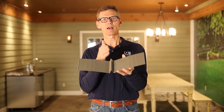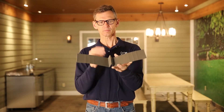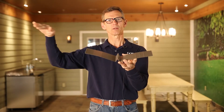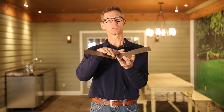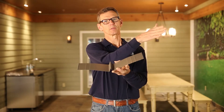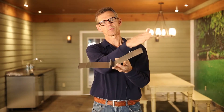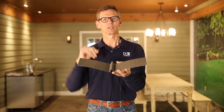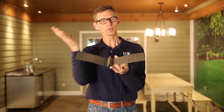So why not line the valley with the most permanent material available for the roof? In this case it's steel. We make W Valley in steel and aluminum. The purpose for the rib in the middle is so that the water coming down this slope gets stopped and prevented from going up under these shingles. The water coming the other way gets stopped at the center and runs down the roof instead of washing back up the valley and getting under the shingles.